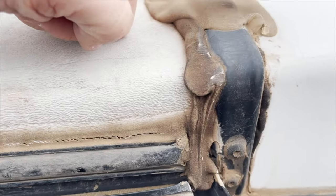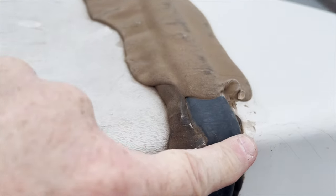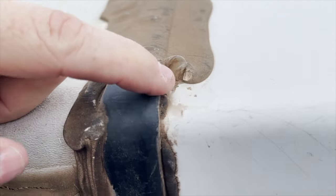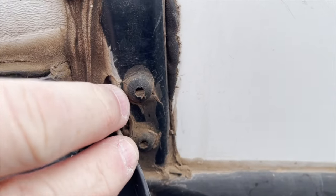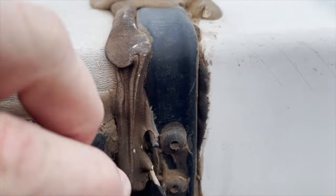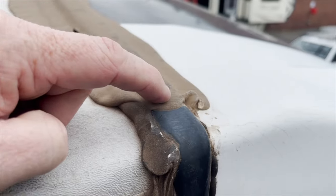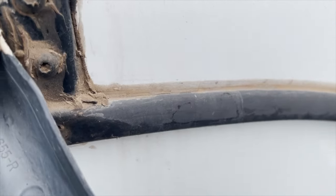The sealants should have been brought out the rest of the way to almost the corner — there's a good inch there that needs to be sealed. You can see where the putty tape has bled out from behind the molding, and they did go ahead and put two screws which is fantastic. I usually like to see a secondary screw toward the end — I call that toenailing.